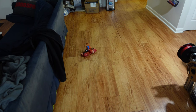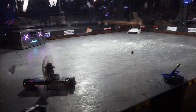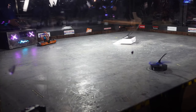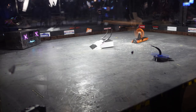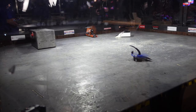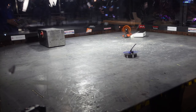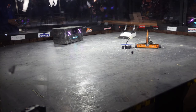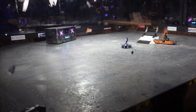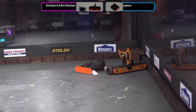What were the biggest causes of failure in the past? As Division is a two-wheeled bot with exposed wheels, there isn't a whole lot that I can do to win a fight if I ever lose a wheel or a drive side. There were several causes for having this happen in different fights in the past. I'll ignore the fights of the earlier version 2 revisions before version 2.7 when I switched to a brushless drive solution. There were a few fights, such as against Bison, where a direct hit to a wheel simply removed it. There were also a couple more violent ones against Eruption, and also Blackbird.